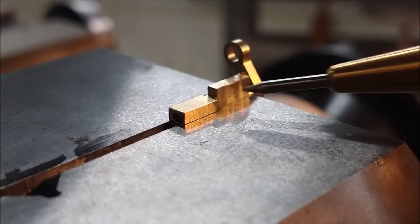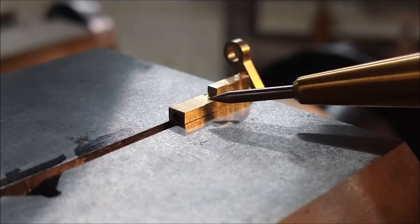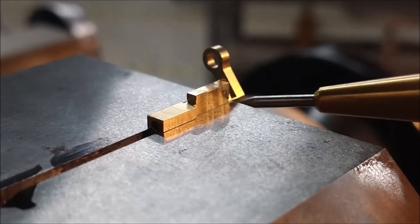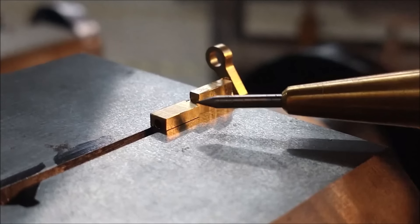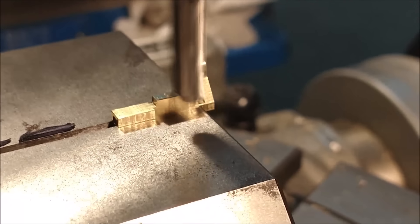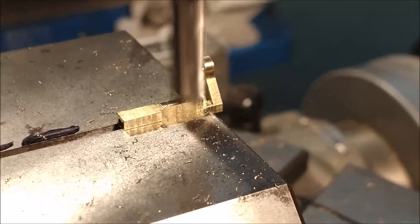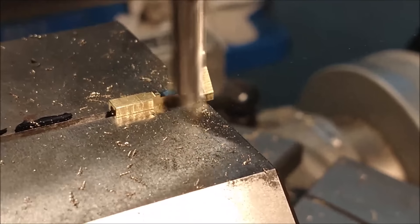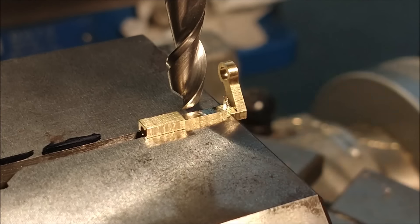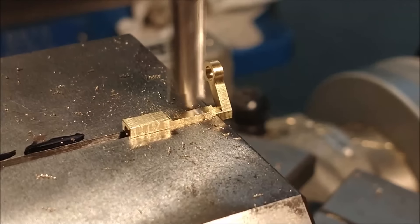This only has to be knocked down to this surface here, because the width all the way back is the same size as the T-nut profile. I'm going to try to get it down to the level of the original slitting saw cut and make it look like the print. The very top surface of this part has the greatest surface area to grip. Just be very delicate — take it down and blend the original saw cut on the lollipop end and blend the two sides of the T-nut from previous cuts. An eye loupe is a good thing to have at this moment.